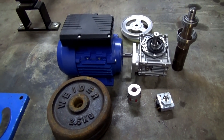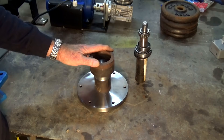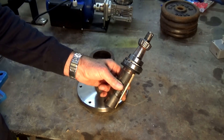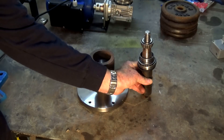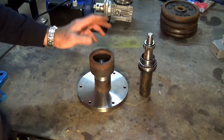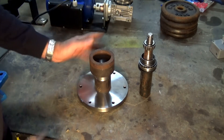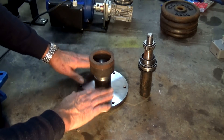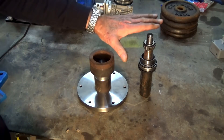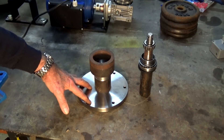Let's get busy. We're going to try and make all these parts and I'll show you bits and pieces as we go along. These elements here are going to form the main bearing assembly which supports the sand muller drum. This is just a standard stub axle for a trailer. You can buy these down at the auto accessory shop. It doesn't need to be in tip-top condition because it's rotating at a very low RPM, and although there are some dynamic loads, it's nothing like you'd find with a heavily loaded trailer.